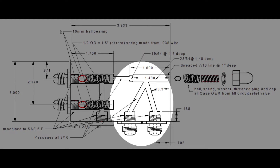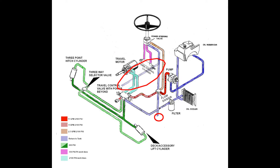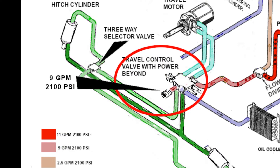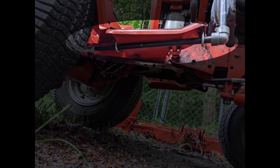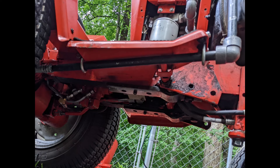Taking a page from Ingersoll's book, this device has two ports in its return to tank cavity, one leading off to the return tank itself and the other receiving and passing along the return oil from the power steering system. The high-pressure output from the power beyond port is routed outboard underneath the right-hand foot rest and terminates at a quick disconnect at the right side of the tractor. The line itself is standard half-inch schedule 40 steel pipe, which has a 5,000 psi pressure rating.